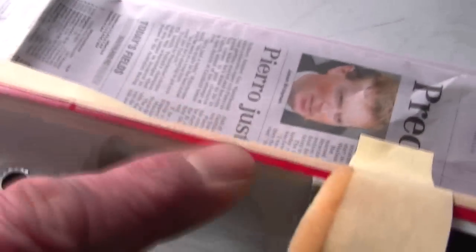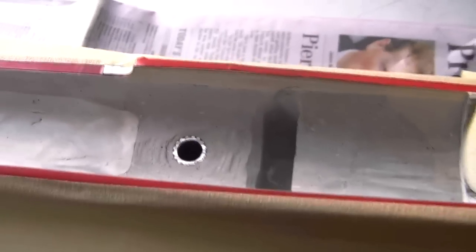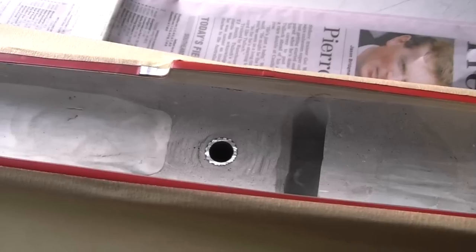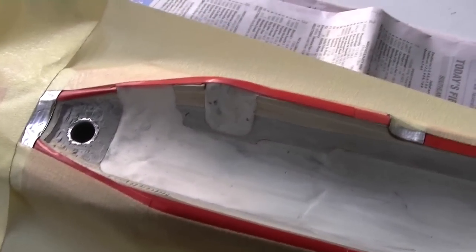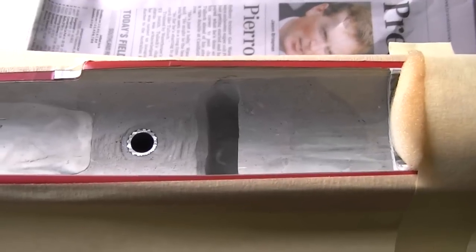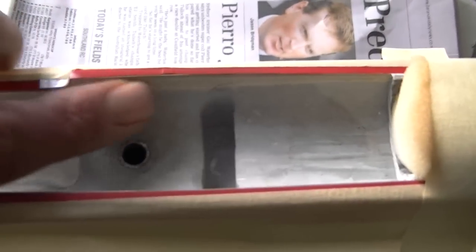The optimal depth for this grind-through for compound thickness would be about 1.5mm, or roughly 60 thou. You can go down as far as 80 thou if you want to, but if you go further down you've got a very large fill, and that can cause problems — air bubbles can occur because you've got such a bulky area and may have mixed air into the compound during mixing. If you go too thin — less than 1mm — especially along the side walls, you run the risk of it being too brittle. The compound has to have some volume for strength and mass. So try to work towards 1.5mm, or 60 thou, up to about 80 thou. In the barrel channel you will end up with more compound; it's just the nature of the beast, especially through the sides of the barrel where there's a step down from the diameter of the action.